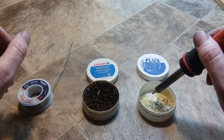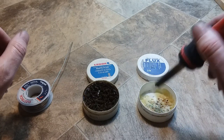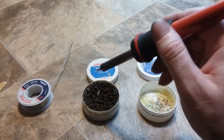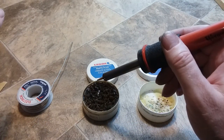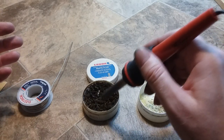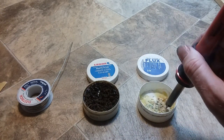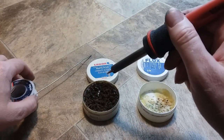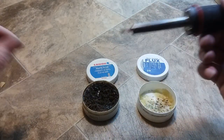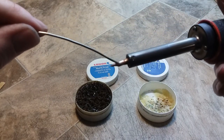If you're working on electronics you want to use water-based flux because it doesn't corrode your electronics if you leave it on there. You can use acid-based if you clean it off with isopropyl alcohol and a brush, but over time the acid base will corrode your electronics — it's more for plumbing. It does flow solder quite easily. As Mr. Chen said, you need to tin your tip — dip your solder in your flux and just let it flow.